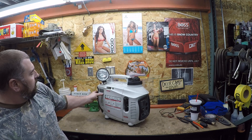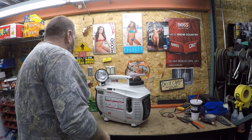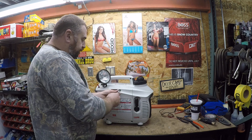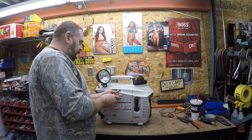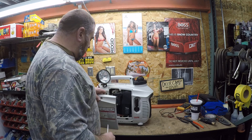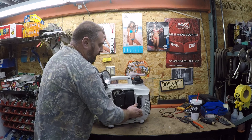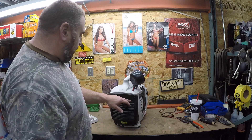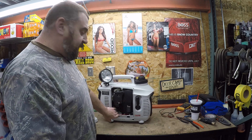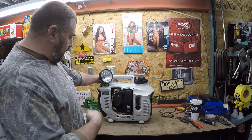Basically what I did here is this is just a tractor light, 35 watt. I drilled a couple holes back here and tied it up in the main panel board, brought it down through here and through the engine compartment. I used number 14 wire, coming in through here. You can access that back here by taking out the screws on the exhaust side — this cover just comes out. They sell kits online, but why pay the money when you can do it yourself?